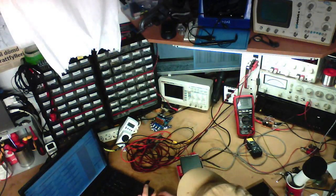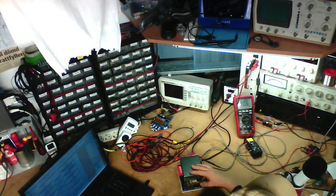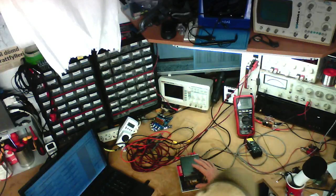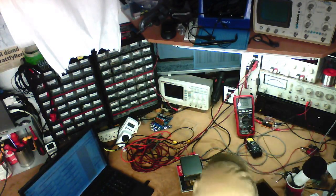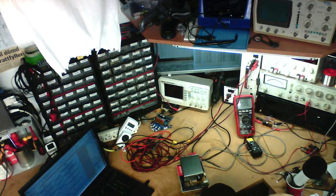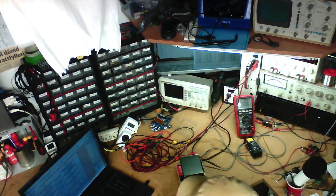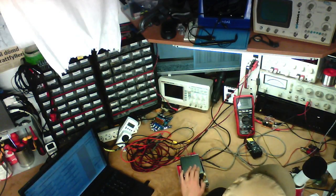Oh yeah, entering these microvolt figures into the spreadsheet also gives us our signal to noise ratio on this Breeze Audio TPA 3116 mini power amplifier. And the signal to noise ratio, as it is usually rated, it would be 94.41 decibels if the volume is all the way to the bottom, or 88.75 decibels if the volume is set to the level required to produce the maximum non-clipped output. Yeah, that's like the numbers you want to compare if you're looking at some other amplifier. You know, that's what they're gonna put in the manual as the signal to noise ratio. So this is, you know, low 90s, which isn't very good, especially for a power amplifier this weak.